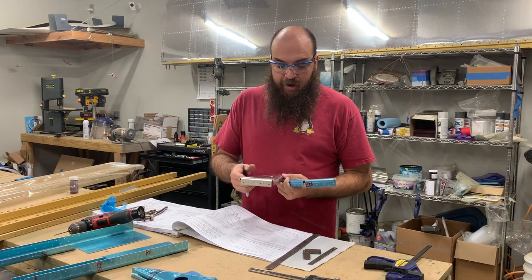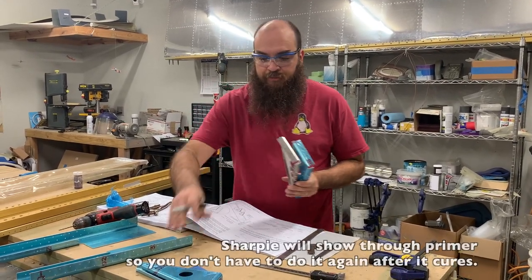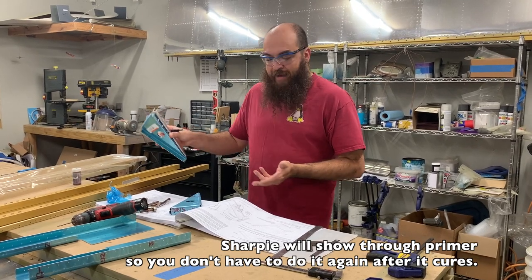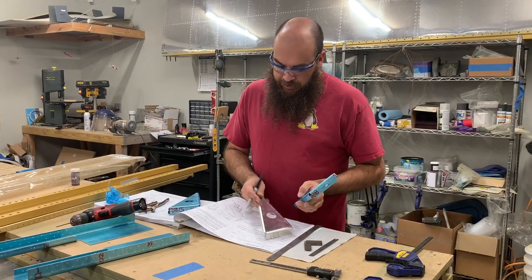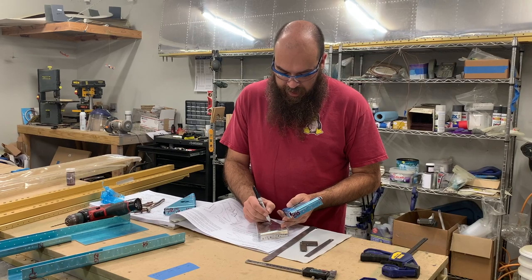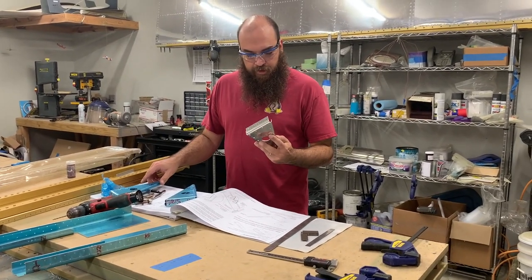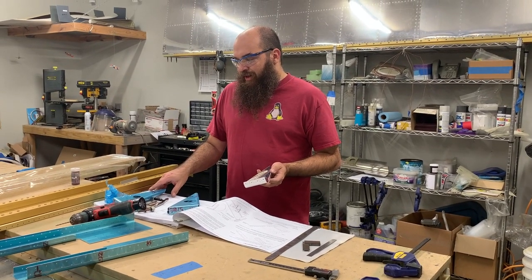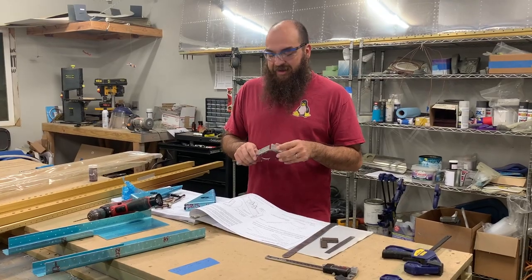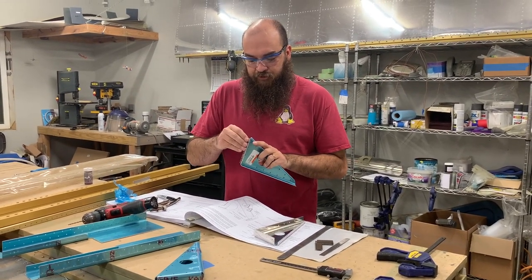They might get covered with primer, but after we scuff them I will rewrite what that is. For example, there are gonna be two sets of these and because we're match drilling, we want to be sure to put them back where we match drilled them. So I'm going to label them: one zero three four PL — call it A, B, C, and D — so they go back to the right spot. These parts are so close that it's usually not the end of the world if you rivet one in the wrong place, but the holes are gonna be tight, so that's not great.